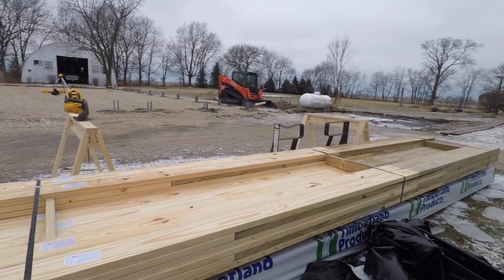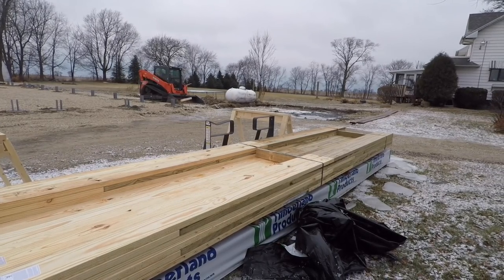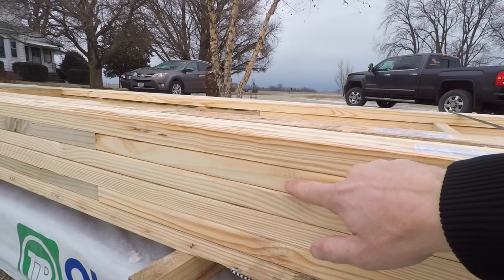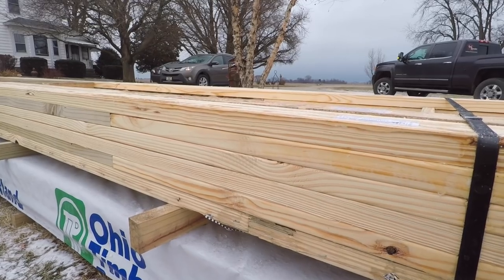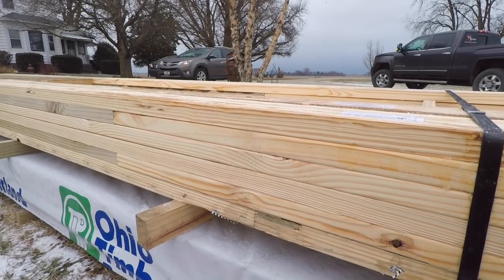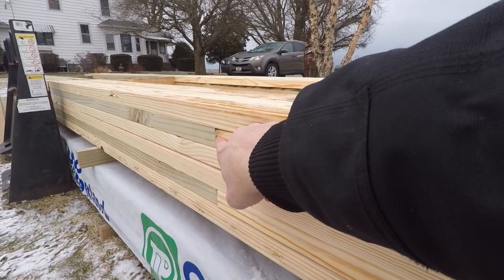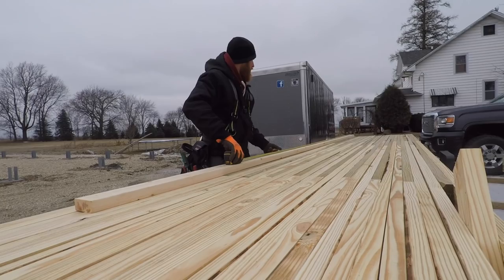It's a great column, rated as one of the strongest in the industry — nice and straight. On this size of building, these are laminated three-ply two-by-sixes, so they take three two-by-sixes and laminate them together. The center ply is notched out because our trusses sit in that center ply pocket. Since we don't know exactly where our piers will land — they could be a quarter inch or half inch one way or the other — this allows us to adjust exactly where the trusses sit.